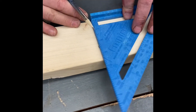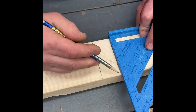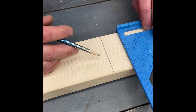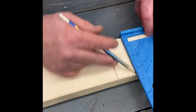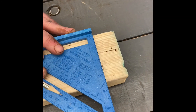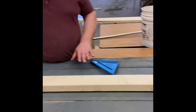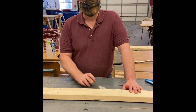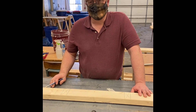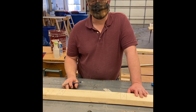X means stud. When we get to more advanced walls with doorways or windows, we'll have king studs, trimmer studs, and cripples. We mark regular studs with an X, but in those walls we'll mark with a C or T depending on whether it's a king stud or trimmer. That's all you have to do to lay out studs 16 inches on center. When we frame, we use two 16-penny nails to tie the bottom and top plates to the studs.